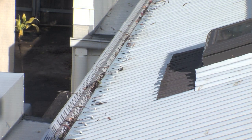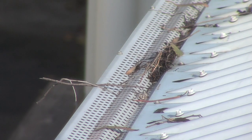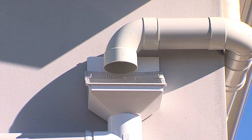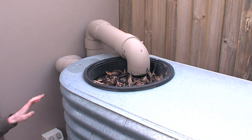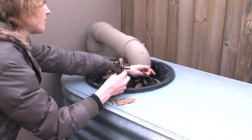If your roof collects a lot of leaves, fit good quality leaf screen to all gutters and roof valleys. If there is no leaf screen on gutters, consider fitting leaf shedding rain heads. Install them where they can be easily cleaned and where some splashing water won't cause a nuisance. Or install a single screen at the point of entry to the tank — some are self-cleaning, others need occasional inspection and emptying.